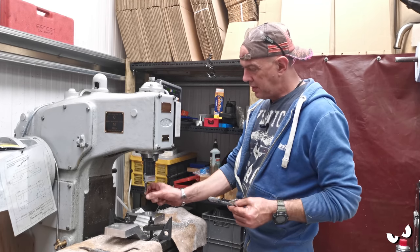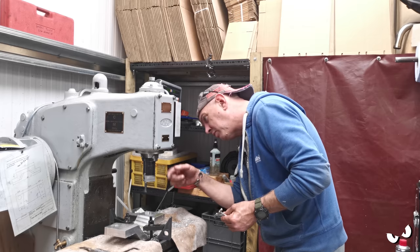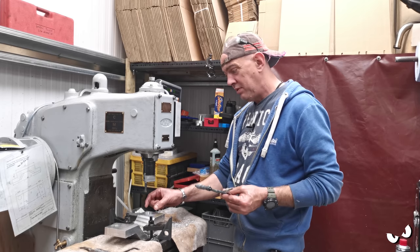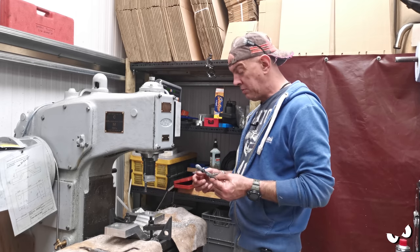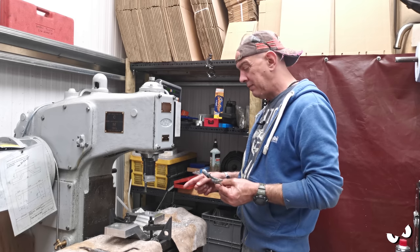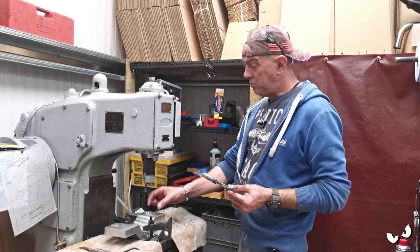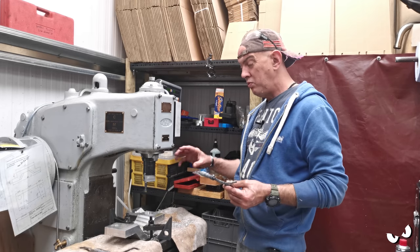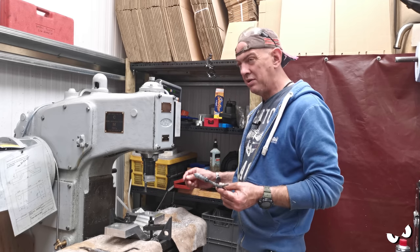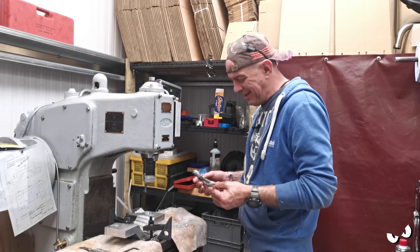So there is obviously some sort of tool deflection going on. But now I've got a measurement. There's a little dial on it that you wind out, and obviously that's how much it's taking off. That's how much you're actually taking off, so double that because you're taking it off both sides, but that gives me an idea of how to get down to it. I'm going for a 0.1 fit on this, so if the forks are 45 mil, I'm going for 45.1, because I want them as snug in there as I can get them, so when you clamp it up using the screw, you're not deflecting this much at all for it to grip. I want it to be a really nice, snug fit, basically.